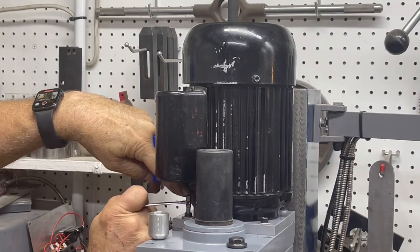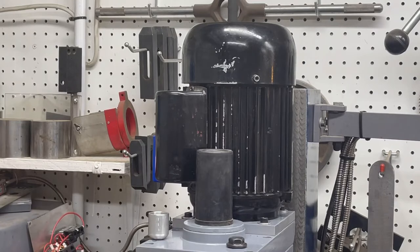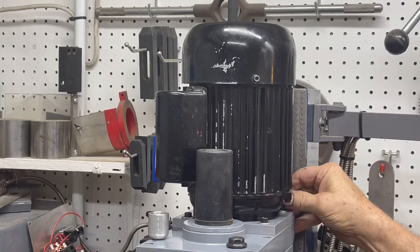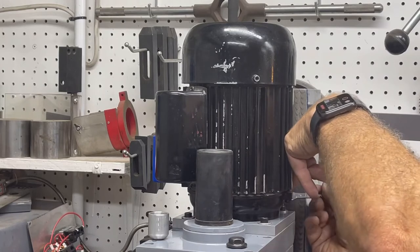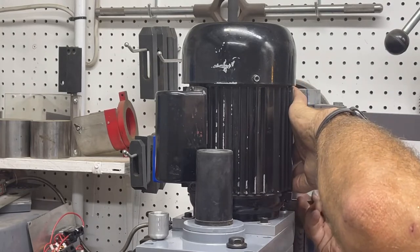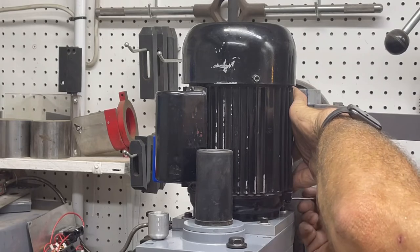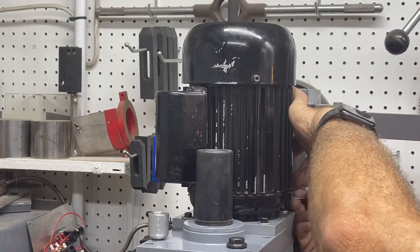I'm torquing it pretty good initially. The washers on these little screws were coned out from being pulled into a hole that's bigger than the diameter of the bolt. I put them on upside down to push that cone the opposite direction this time, so it makes it seat better in my view. Mozart in the background, some woman screaming.